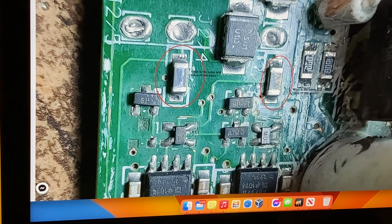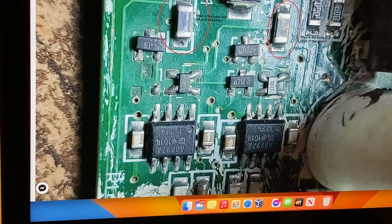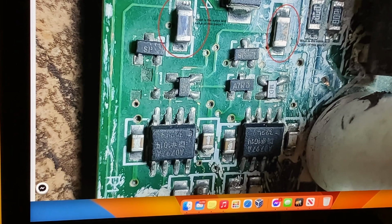Then you get your flyback voltage come through, blows this one up, blows that one up there, shorts out some of these diodes, they go into conduction. You'll see all these smoked, and I don't think from memory it'll blow up the BF908s. It can, but I don't think it will. Depends on the voltage coming through, but I have seen them. It also takes out one or both AD797s.